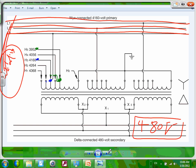So what they do, in the summer they set it here, and they come back in the winter, see, and they set it exactly where it used to be. So they move it, physically, mechanically move it. That's one type. Physically, mechanically go to the top of the transformer, and the utilities will adjust it. That's one type. The other type that the utilities use, guys, they call it auto voltage changer, voltage tap changer.